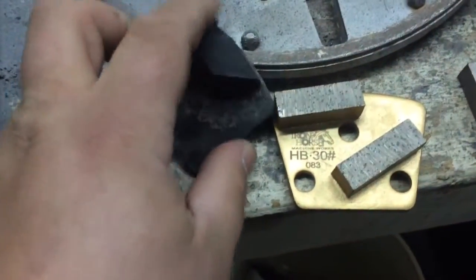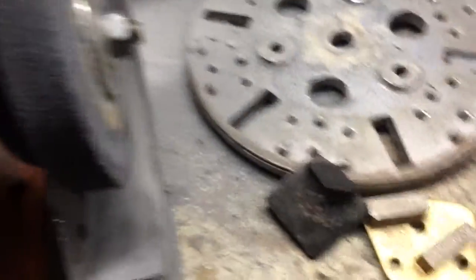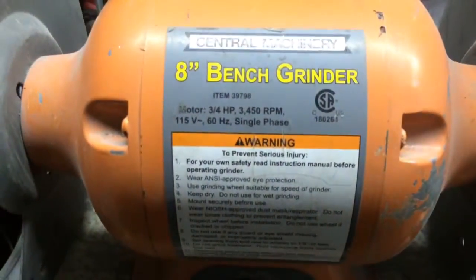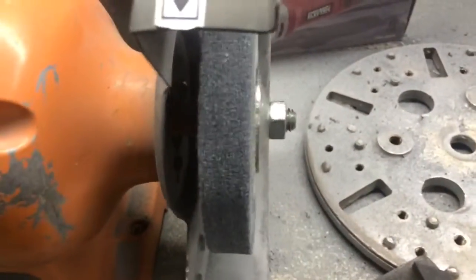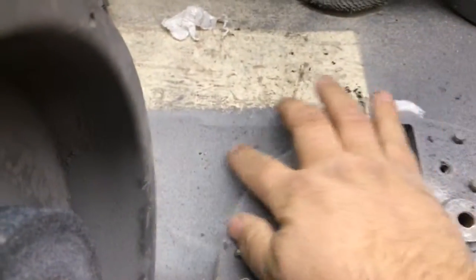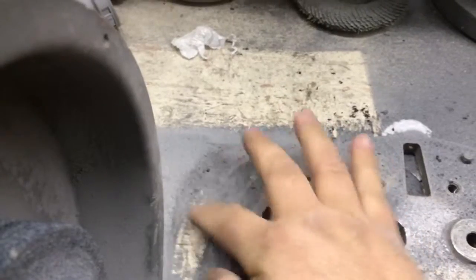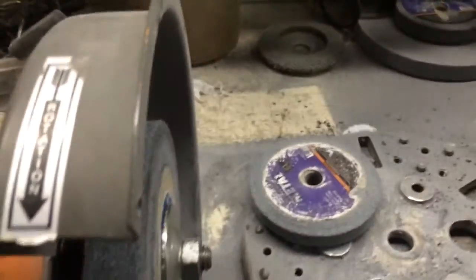This is what it looks like after we solder the tooling, and what I'm going to do is go ahead and show you how to dress that on a standard Harbor Freight 8-inch bench grinder. You will wear through your tool a little bit through the wheel. As you can see back here, I got another Harbor Freight special the other day — I couldn't resist. You can see how much that wheel wears down. Here's a wheel that we wore down. I'll go ahead and turn it on and show you how we dress those.